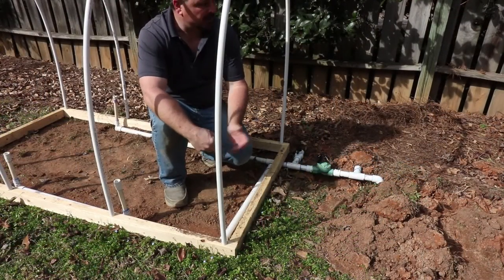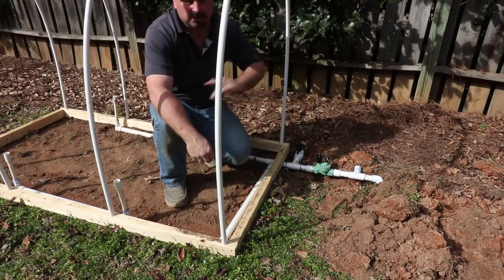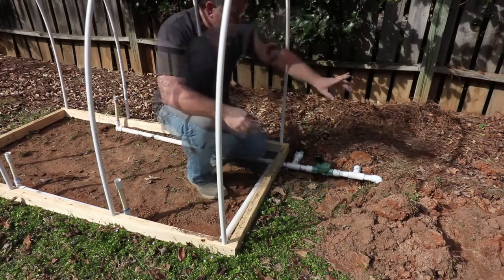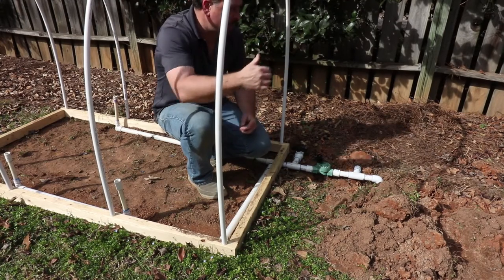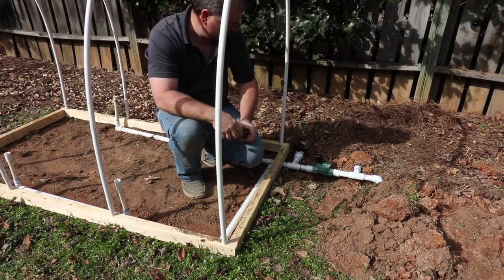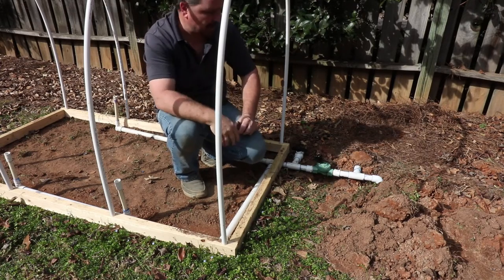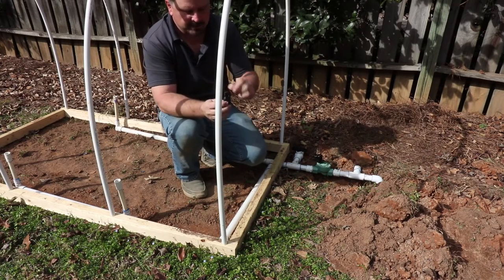I'm going to give you a few pro tips. Number one: never cover your line before you turn it on and pressurize it — make sure you don't have any leaks. Number two: never turn the water on without the valves open. There's air in that pipe, and if we don't allow that air to come out, we can get water hammer — where the water compresses that air and slams against it until it finds weak points in your pipe and causes big problems. Third: never put the irrigation heads on before you blow the pipe out. We got dirt and glue and rocks in there — we want that to blow out before we put the heads on, otherwise they'll get stopped up.